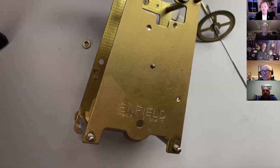And Rob said, could you use polymorph as a boxwood chuck? Be a really great experiment. The only thing I would say is you're going to have to really keep the temperature down because of its melting point, or I think maybe call it glass transition temperature. So definitely worth an experiment there. As I said last week, we have used it for really difficult work holding in the lathe. It's absolutely brilliant for that. So a useful little product.